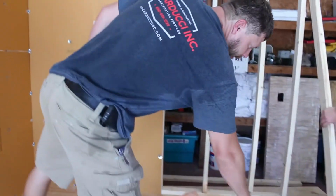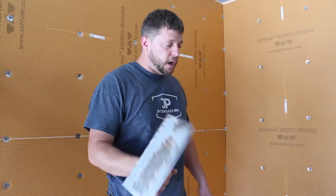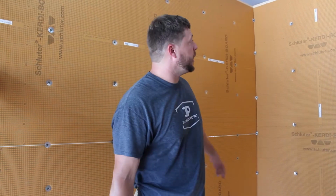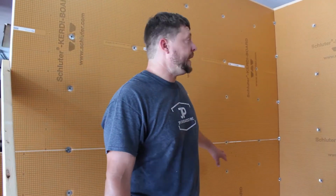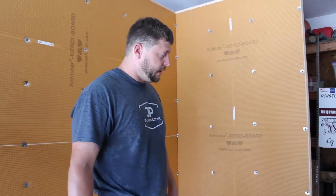First off, you need some unmodified thin set, is what Kerdi recommends. There's actual talk on a website called John Bridge. It's a tile website. If you go on there, very informative. But they actually use modified thin set where they're getting a better hold and a better adhesion. So unmodified is recommended by the company. It's not set in stone, but you can also use modified. It takes a little longer to dry. We're going to use what we got today. I think it is a modified, but we're going to use what we have.